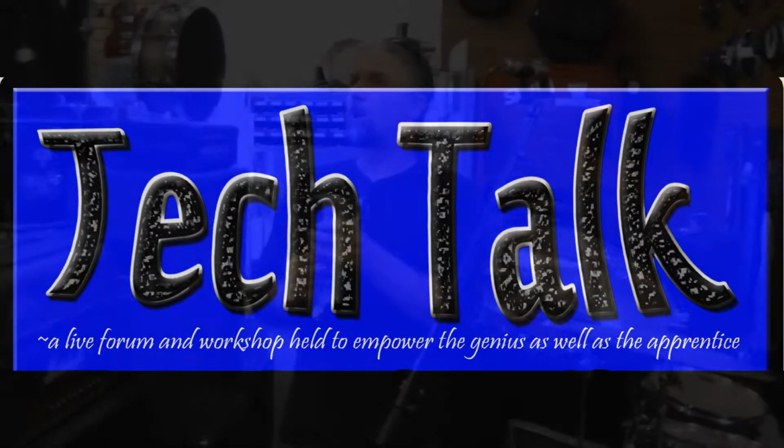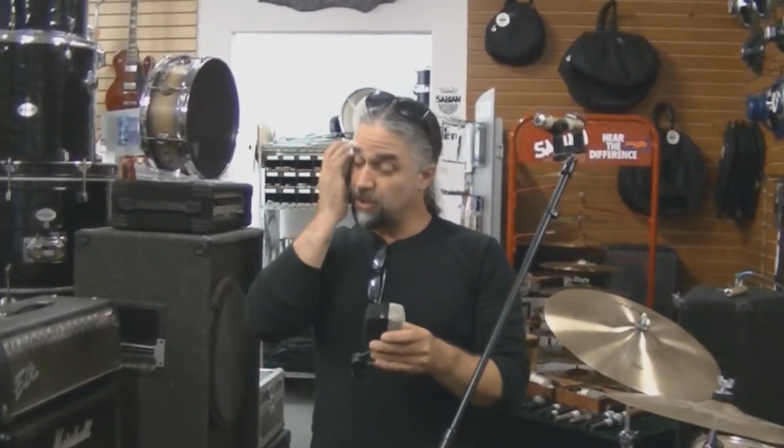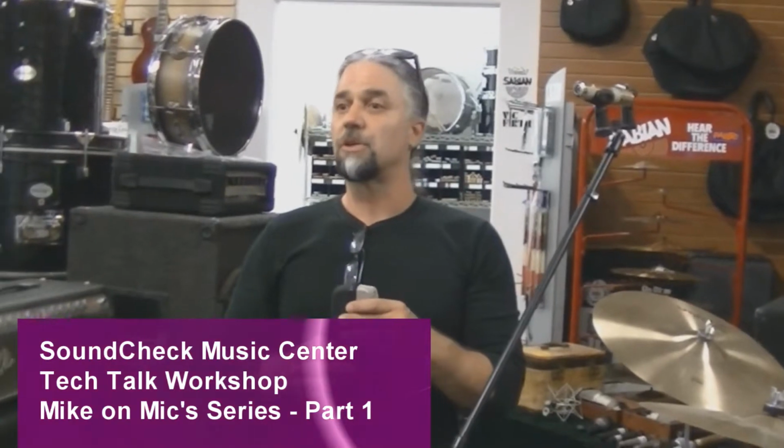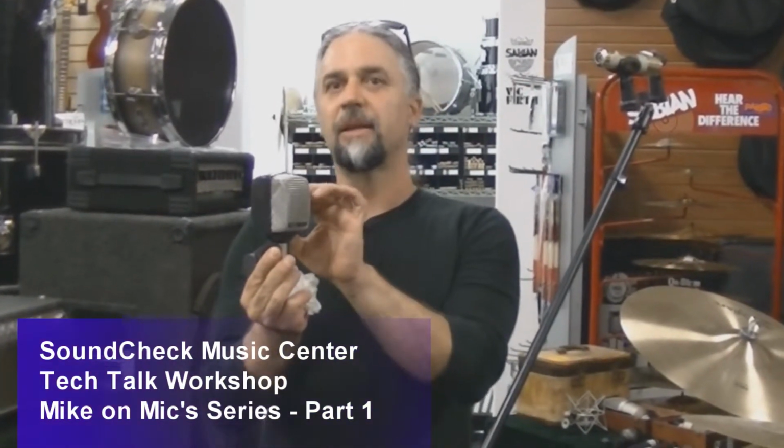The AKG D12E, and it's from the late 70s, early 80s. They were using it a lot. And how it changed, the AKG D112 is used nowadays. You see it all over the place, live, in the studio. It started with the D12, which was their original, it's a dynamic mic. But the way it works is they put a bass chamber inside, and what it does is it gives you a 60 to 120 hertz bump. And a bump is a 3 or 4 dB bump.